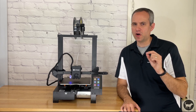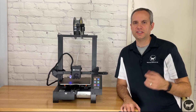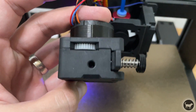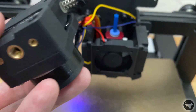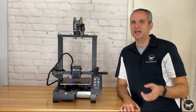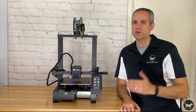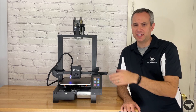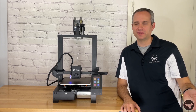There was just a small bit of plastic preventing me from adding my next spool at the extruder. It's just a bit more of a process to remove the cover, detach the extruder, and open it to clear the clog. At least it gave me an excuse to see how the inner workings of the machine operate, as I always like to know how everything is constructed. I'm not blaming the extruder or the machine for this issue, as it was older filament and happened to me only once among the few times I changed spools, but it happened, so I'm mentioning it.